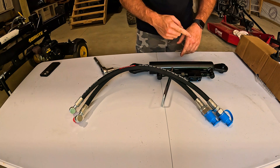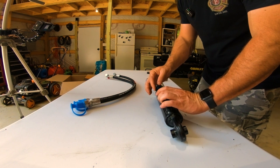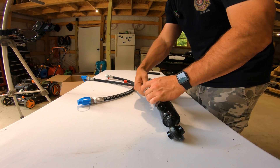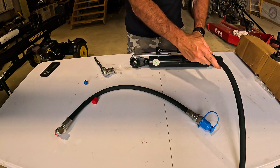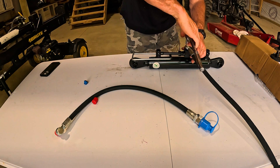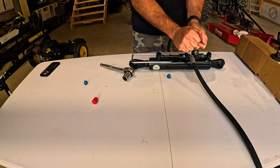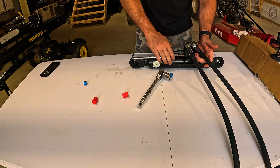What will really make a difference is how you connect it to your tractor — we'll go over that in a bit. These two ports are just hand-tight so I'm going to loosen one and put one of the lines on it. I'm sure we'll have to make some fine adjustments. This part is going to be facing the tractor so I want my lines pointed that direction. The wrench size you're going to need is a 7/8. I'm not cinching these down just yet because I'll need to make adjustments at the tractor.